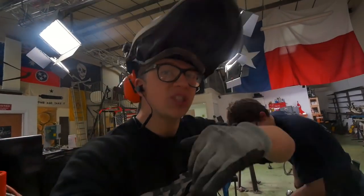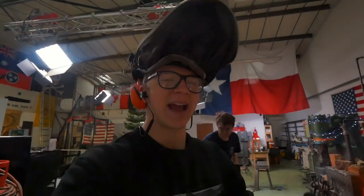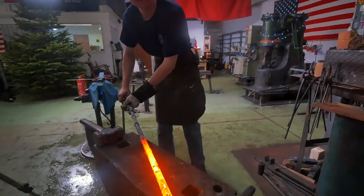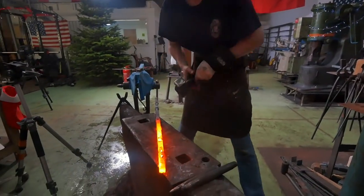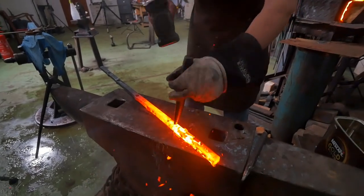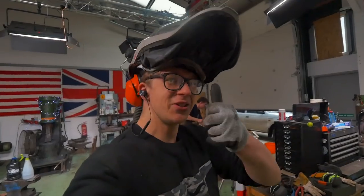This is where you punch down with a large punch, that creates a countersink, you flip it over, you use a small punch, you pop out a little plug, giving you a wonderful little countersunk hole that works just fantastically for screwing it into the wall or into the boards to hold the shelf. And he's doing a great job.